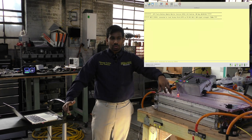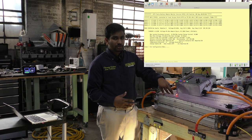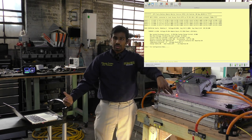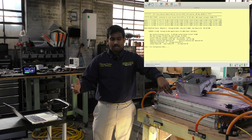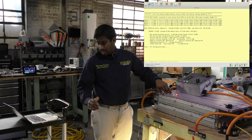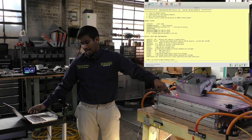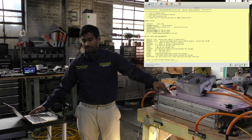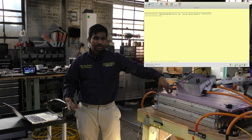To demonstrate, I'll set resume equal to 3.7 — changed — then enter 4 again, and charge enable is forced off and stays off. Enter 4 again and charge enable comes on and stays on. Command 4 controls charge enable on and off. This can control chargers or other devices such as an MPPT charge controller for solar — you'd wire this to a relay that disconnects or connects to start charging the batteries. Charge resume is the voltage at which the controller allows charging again; charge cutoff is the voltage at which it stops charging.